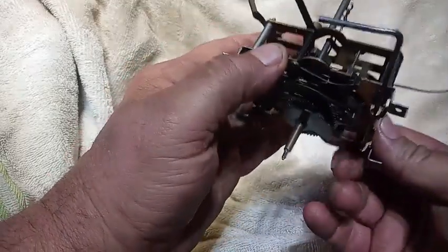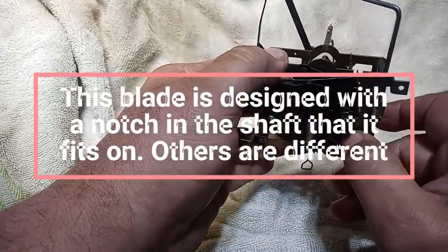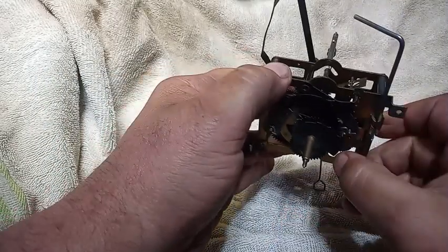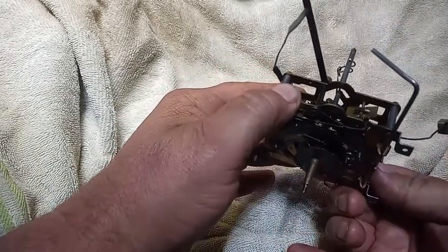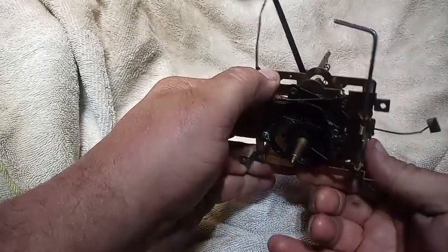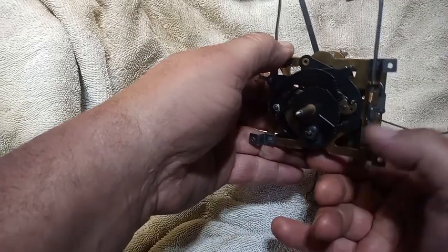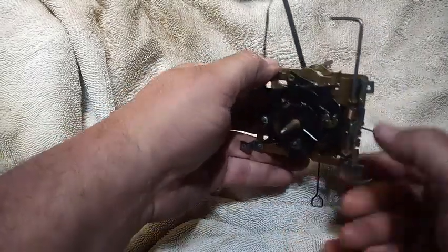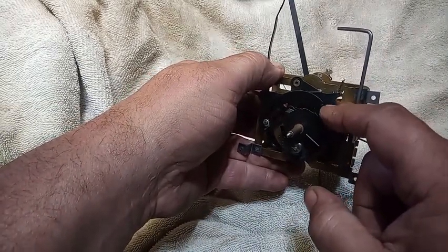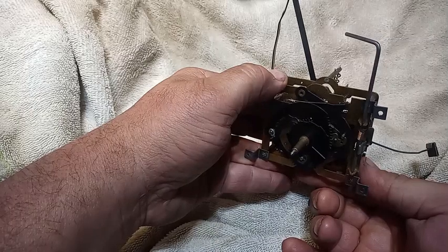When I activate the cuckoo, you're going to see it continue to spin. You see that? The cuckoo was done and it continued to spin. One more time. I'm going to do it again so you can see the rack and snail, and watch the governor fan. As soon as this gets underneath the rack, you'll see the governor fan continue to spin.